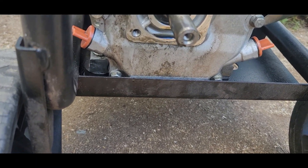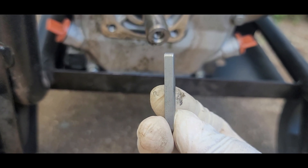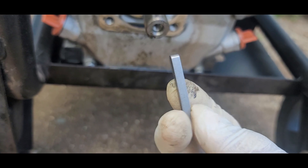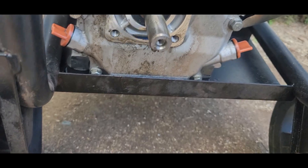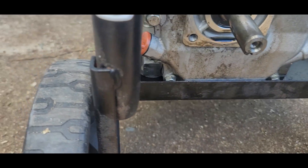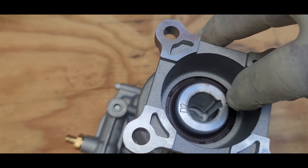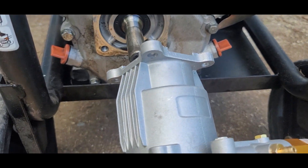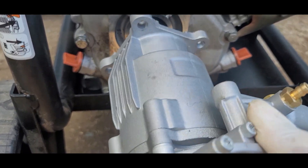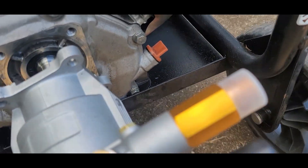You can actually swap the old shaft key with a new one, but they're unlikely to be damaged, so I'm going to leave my old key in. My old key is at the bottom, so I'm going to line up the indentation with that key. Just push it on and give it some turns until you feel it line up.